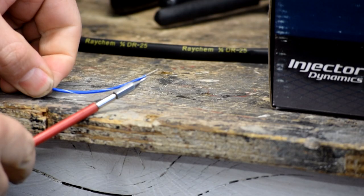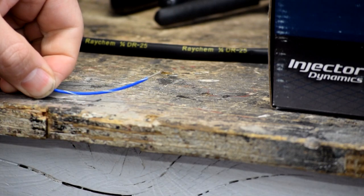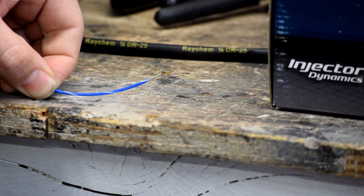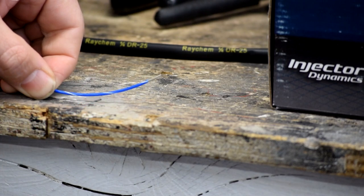Here we've got a section stripped off. You'll notice the wire looks silver — although this is multi-strand copper wire, each wire is individually tinned. This prevents the copper from corroding, so if any moisture wicks its way down the wire, each individual strand is protected by the tinning, making this wire extremely corrosion resistant. The wiring harness made out of this stuff is smaller, lighter, still carries the same amount of current as equivalent gauge wire, but it's way more corrosion resistant because the wiring is individually tinned.